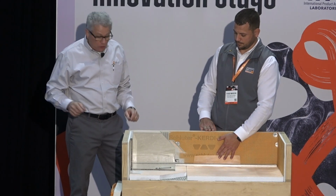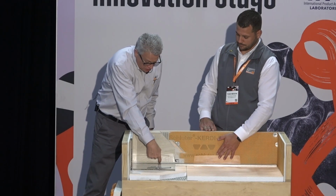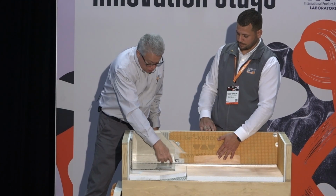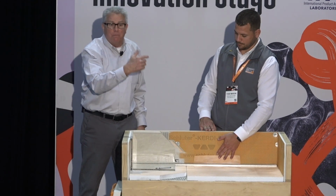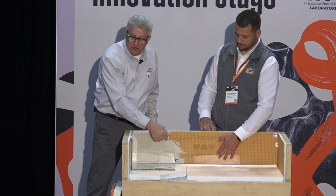And once you're all done grouting and maybe even putting a bead of caulking back here, you can see here we're actually using one of our profiles that eliminates the need to caulk where you change in planes. So we're using that there instead, but that would be your option to either go with a pre-manufactured movement joint or put some sealant back there to seal that up to promote the water to really fall into the channel.